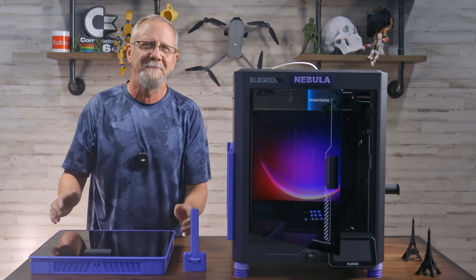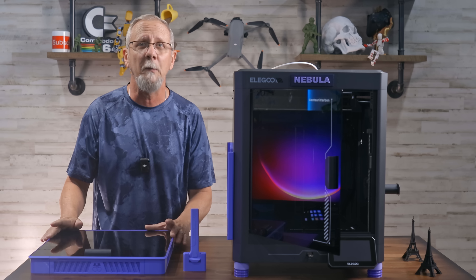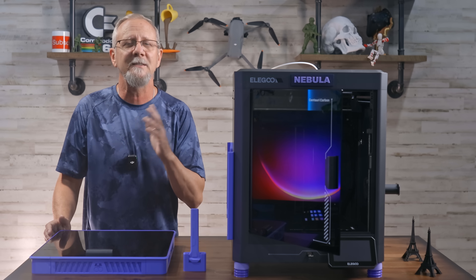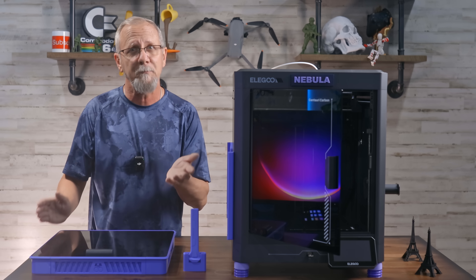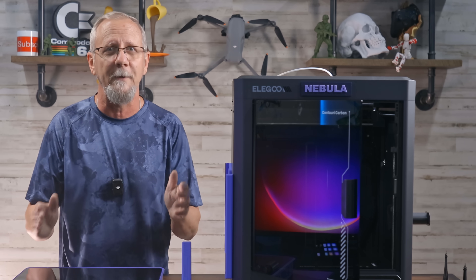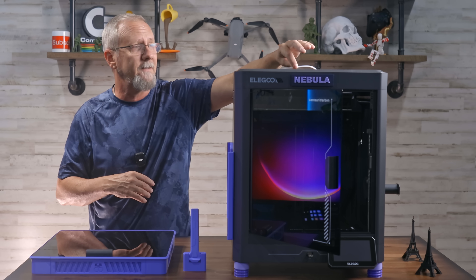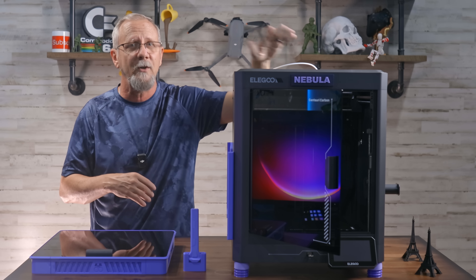Some have carbon filters, as this one does. I got some stern feedback from a user about the modified riser that isn't completely sealed — I'll primarily be using PLA and sometimes PETG, so it's okay. I did close the vents to print TPU and had zero issues, but if I used more abrasive materials more often, I would probably consider using one without vents. Concerning the riser I found on Printables, it's necessary to keep the PTFE tube from rubbing the overhead and pushing down on the filament tube, which can cause kinks and rub marks on the top of the glass over time. I use this on all of my enclosed printers.